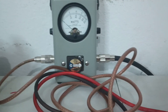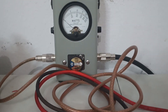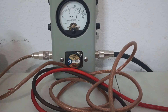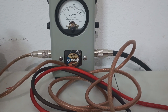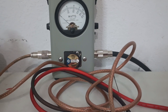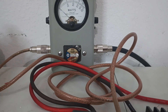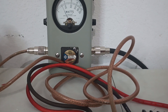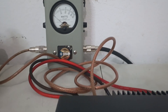Now if we turn our RF power wide open, our peak power is not really going to come up any — we'll see if our average does. This is wide open. About a 20 watt dead key. And the average does come up quite a bit — 75, 80 watts average. PEP is not going to come up much. If we turn it back to nine o'clock, let's see if we can get like a five watt dead key. Audio check. 60, 70 watts average power there. So that's what she's doing on AM.